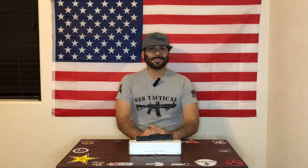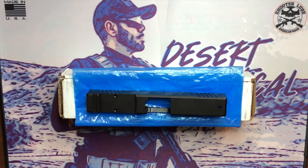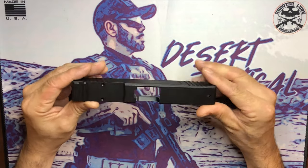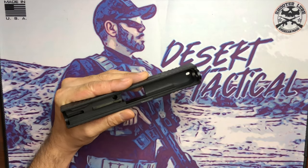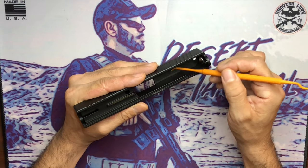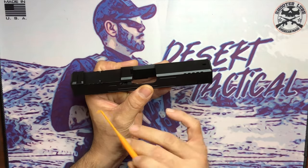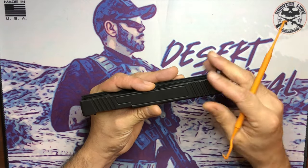For those that care about packaging, it came in a white box wrapped in a blue bag covered in oil — nothing fancy. As far as the slide, my first impressions: it's not too bad for $89, looking pretty good. I don't feel or see any rough edges or burrs with the milling. However, I did notice very minor, barely noticeable tooling marks here and under the hood on the front of the slide — very minor, I don't think it'll affect function. The slide came in with rear and front serrations and some panels, which I'm guessing would be a good place to engrave something.